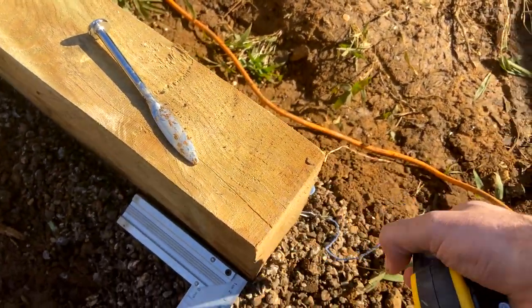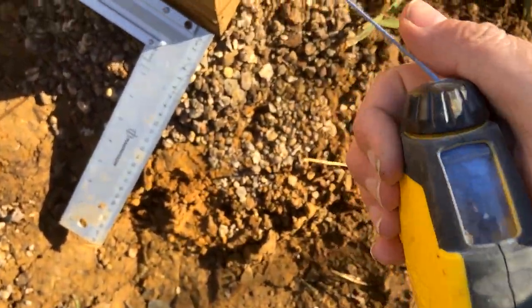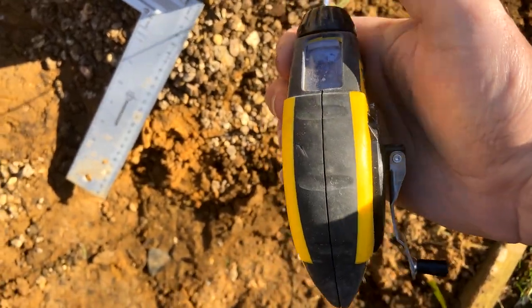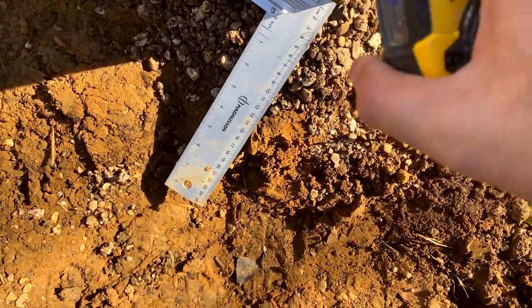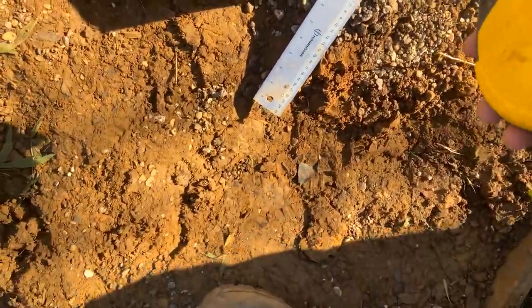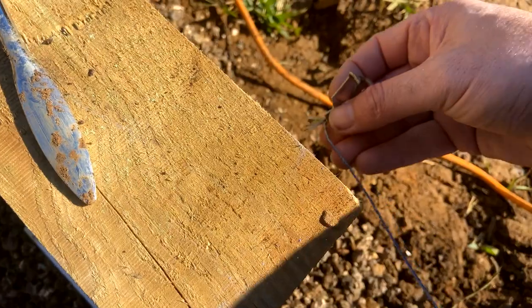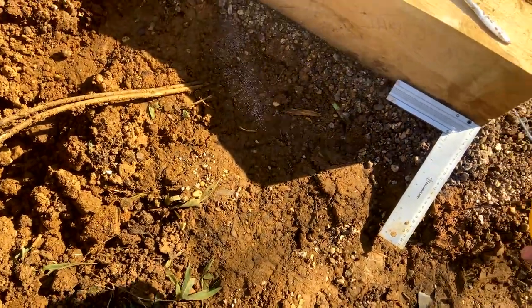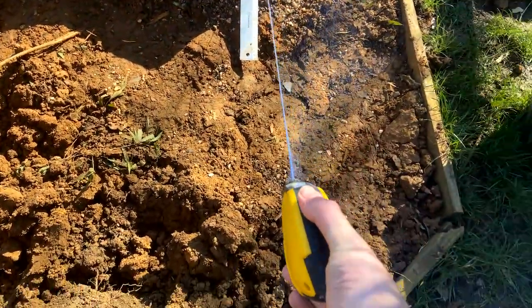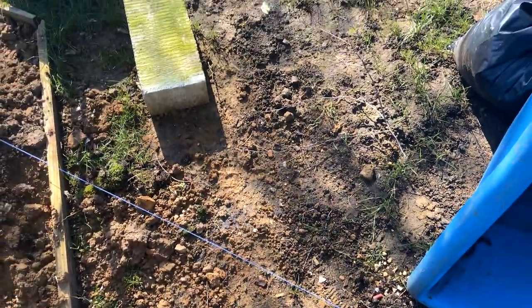I've got a chalk liner, which is basically a line, and inside there you add some chalk. Unscrew that, put some chalk in it, and when the line is tight, you can flick it against the floor and it'll leave a line. But I won't be using it for that reason today. All I'm simply going to do now is wrap that round, push that in there, and then run this backwards like so. And then I'm going to measure out how I want that to go.